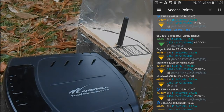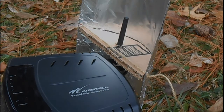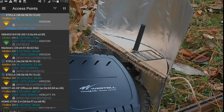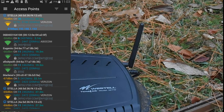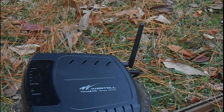Okay, that was fine. And then now, 180, facing the opposite direction. And for some reason it's right now reading at negative 55 decibel milliwatts, but it's going down, which is good. And now we're going to do it without the parabolic reflector. Now it has no more parabolic reflector, so the signal strength is better than when it had it facing 180.